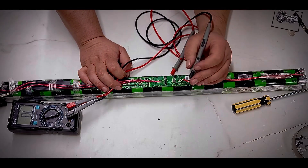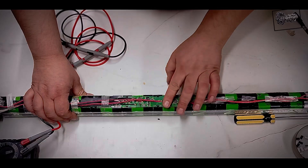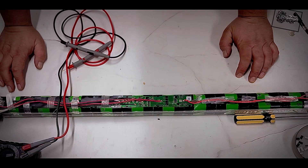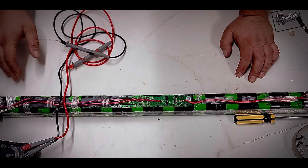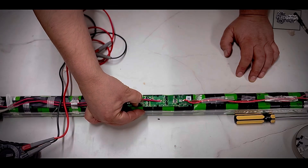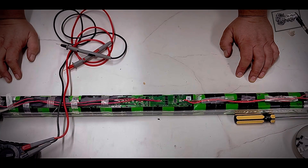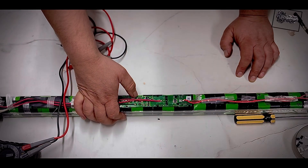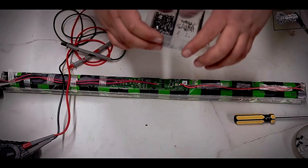On top of the diode problem, you may also find issues with a MOSFET, or the control side may not be good — those are different issues I can't solve in one video. But this battery doesn't have any other problem. The only thing needed before fitting it to a bike is replacing these two diodes. I've done over a thousand of them and none of the originals are good. These diodes protect the BMS from going over 72 volts.